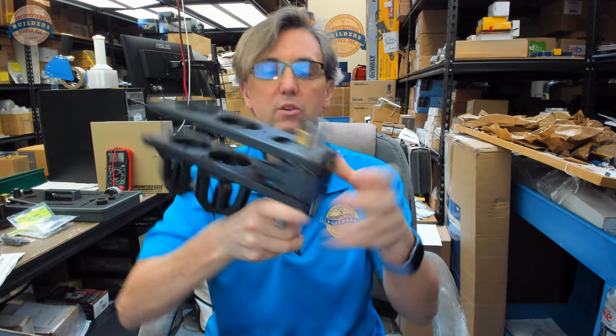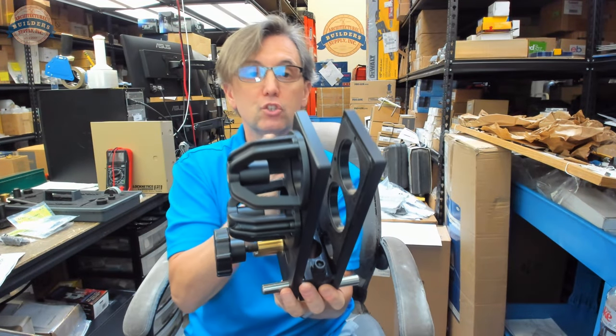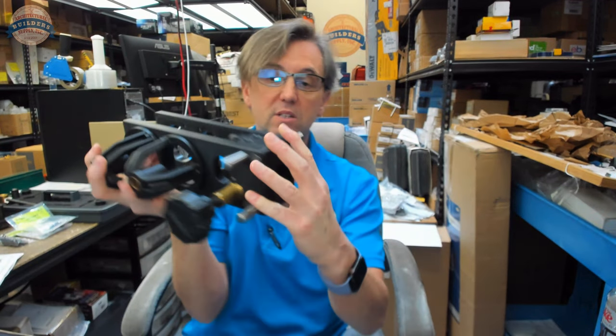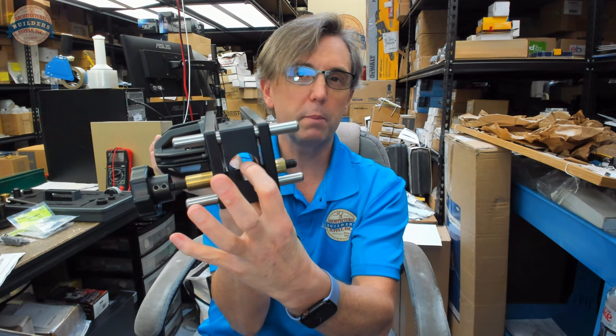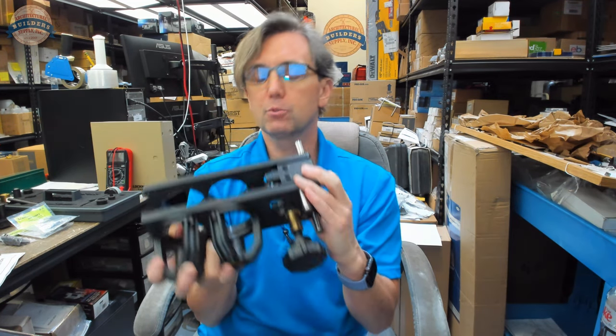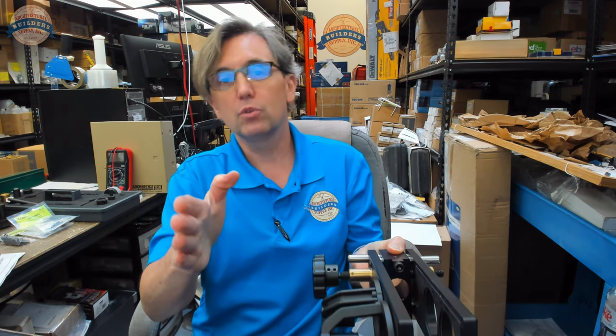We're going to be able to center the tool. What's interesting is you can even change the center line of where you're going to drill the 7/8, 15/16, or 1 inch, probably just 7/8 or 1 inch on this, where you're going to drill that hole for the latch bolt in case you have like a 1 3/4 inch thick door, but then there's 1/4 inch of plywood on one side for some reason. You can alter this tool to adjust the center line for that.